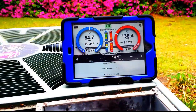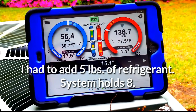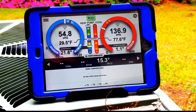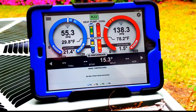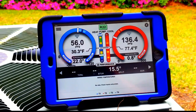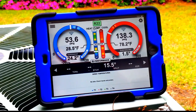After about three pounds of refrigerant we're up near 55 pounds. We're below target in both arenas but we finally have a little bit of sub-cooling, bouncing between 0.5 and about one — 15 degree split. Keeping in mind our split is going to be higher because our airflow is so low. Airflow slows down, the air cools more as it crosses the coil — because you're going slower across it, you have more chance to cool, so the air is going to be colder. I would expect our split to be real high even though we're not doing a stellar job of cooling.